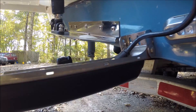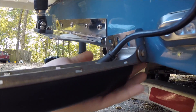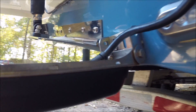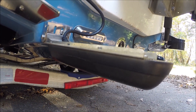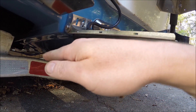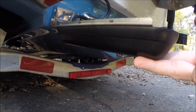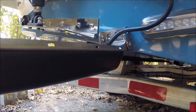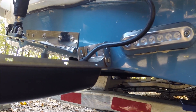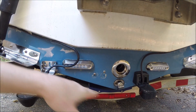You can see this is a 3D Structure Scan transducer. It is mounted very low so even at full speed the entire transducer is in the water. I'll start with the transducer almost level because when the boat comes up on plane it'll lower the transducer. I always want to make sure the following edge is the lowest part of the transducer — this increases pressure across the face and squeezes out any air bubbles. You can see on the transom where it's mounted it's very low.